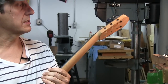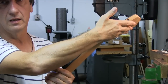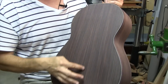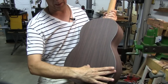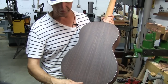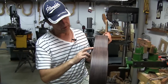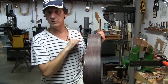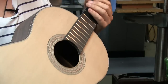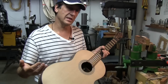She and I had a long talk about all the details. She did not want the veneer between the headstock overlay and mahogany. She did not want the back strip which you usually see on the seam — these are made out of two bookmatched halves, joined so finely you cannot see the actual joint. And she did not want the two lines dividing the back. She also required the binding to be Indian Rosewood, and we went over quite a few things before she said yes.